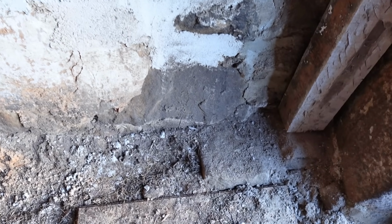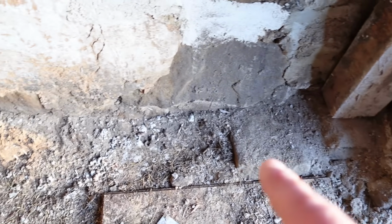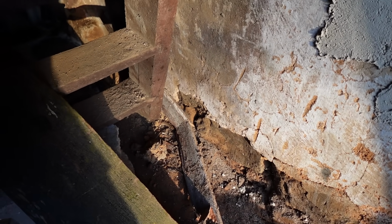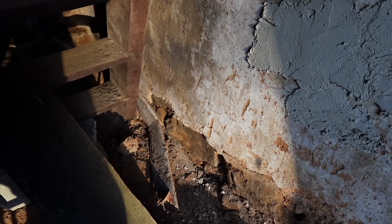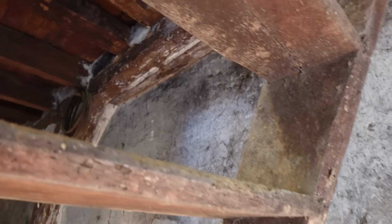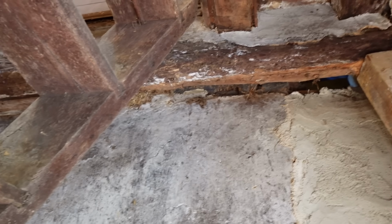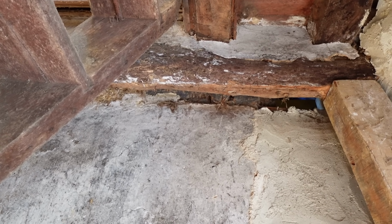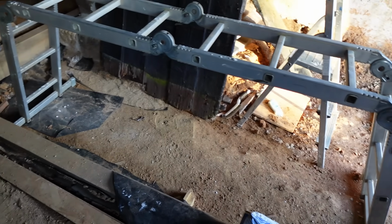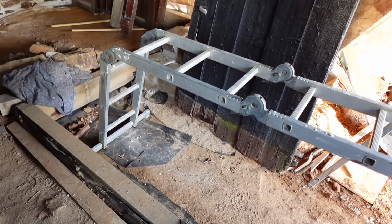Now I've got to sort out the foundations for that across here. It's going to be a bit of a challenge because it's not very straight. So I've put this pad stone in, but really I've got to dig that out, put a foundation down. That way the base rail will hold all the timber uprights, and then we'll just pick up the underside, hopefully, if the levels are correct, underneath that beam there. Now in this particular quarter here, this is the entryway section, goes up to the edge where the stone steps are behind.